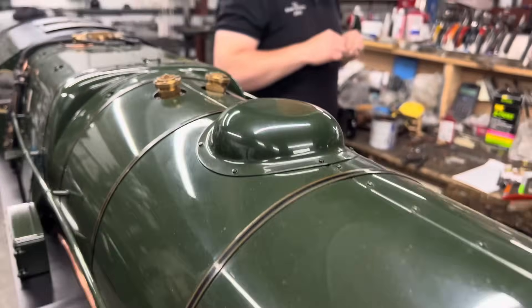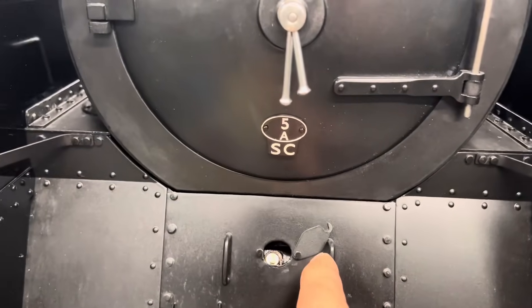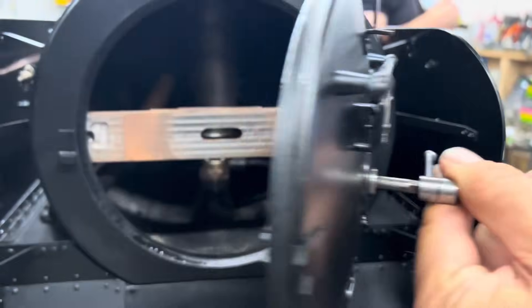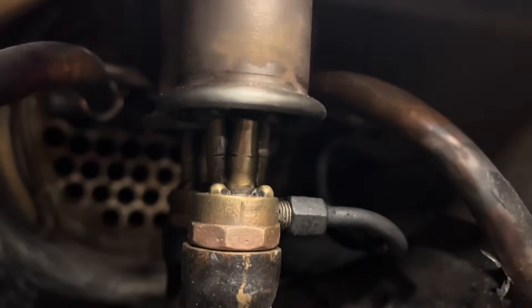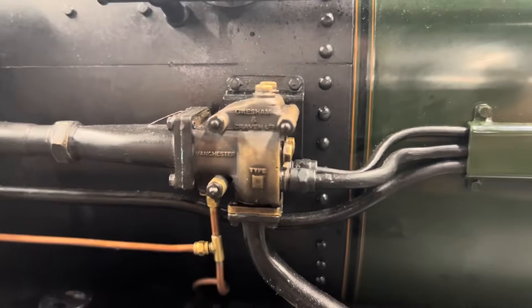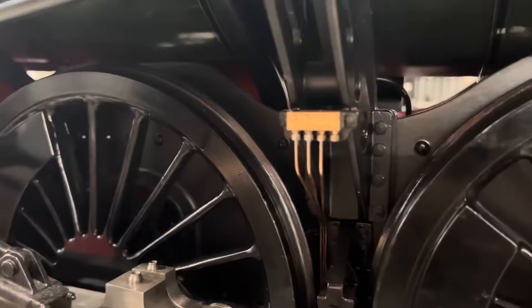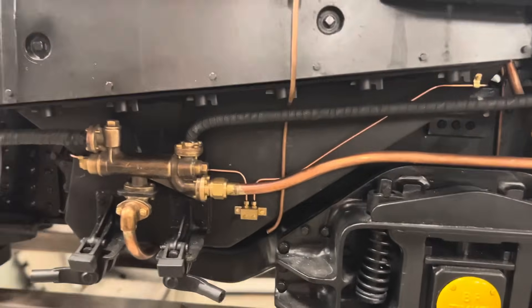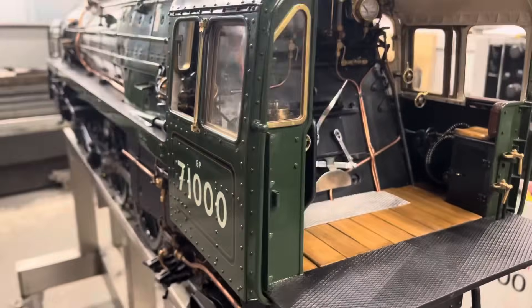Moving on from the safety valves on the top of the boiler to the front of the locomotive, there's a little inspection cover to get oil into the cam box on the front and the inside middle cylinder. Going inside the smoke box, you can see they're not just simple blast pipes — it's got Lempor nozzles, eight in total, to direct the jets of steam efficiently up the venturis. The vacuum ejector on the side of the smoke box has been chemically blackened, and we saw that working earlier. Now just a general walking tour of the locomotive so you can see some of the detail: the grease pots, the oil runs, drain cock valve — to give a general idea of the level of detail that we've created.